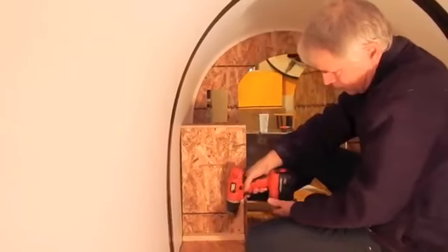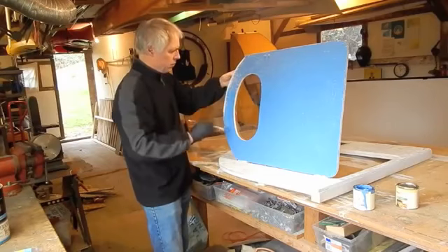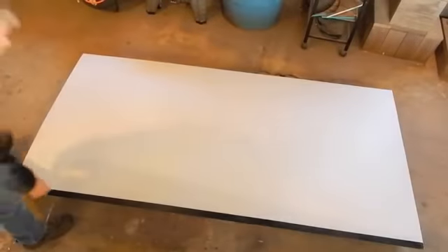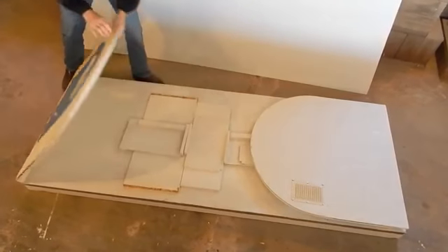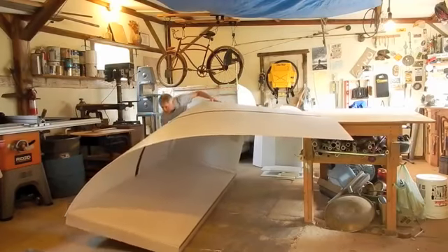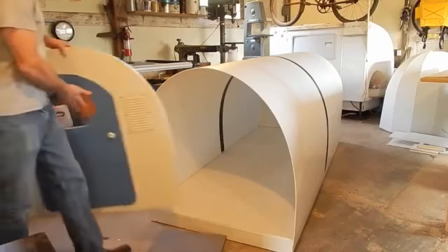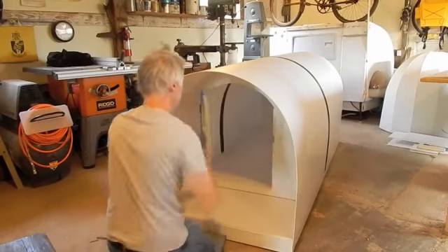Once the shelves were assembled and installed inside the shelter, everything was pretty much figured out, so I tore it all apart and painted it up. This is how it's collapsed and delivered to somebody, and this is how you put it together. Once you have the back side screwed down, you take the sheet, screw one side down, find the old holes, roll it over, then attach the panel to the other side. A person could use piano hinges to secure the two side walls — that'd be handy — but here, being a prototype, I just did it this way.